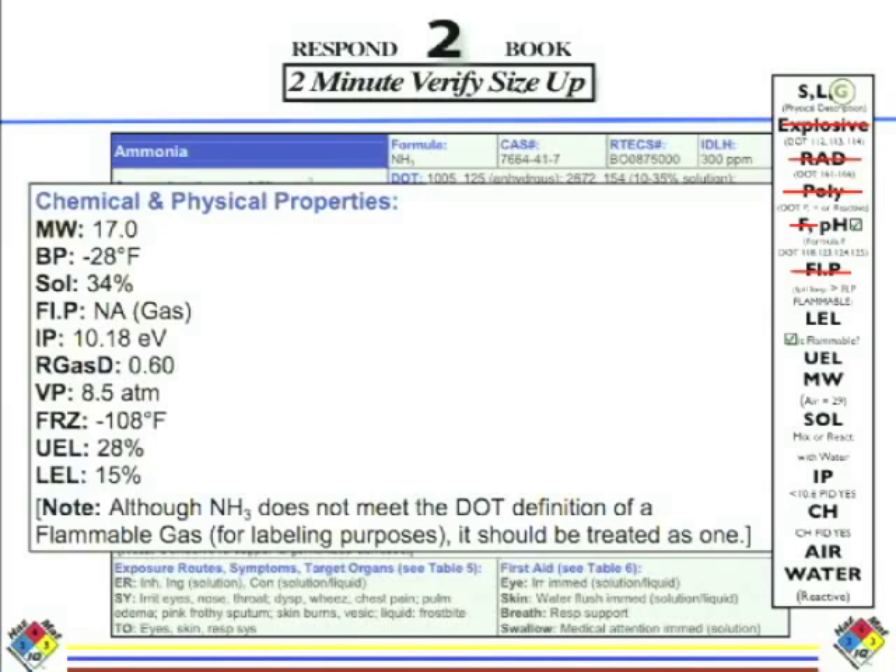The reason DOT doesn't classify it as flammable is they've made their own definition and ammonia falls just outside the LEL and UEL range. But remember — outside, ammonia flammability is not that big an issue; inside, it's a big issue. One important point about using an LEL meter with ammonia: don't bring your LEL meter into a corrosive gas or you might fry it. But at Hazmat IQ we recommend you always bring your LEL meter in. If it goes blank in a super-high concentration, in our world that's a red light — if you can't measure LEL, you shouldn't be in that environment. So remember: bring your LEL meter.